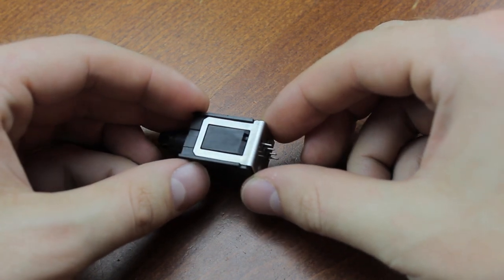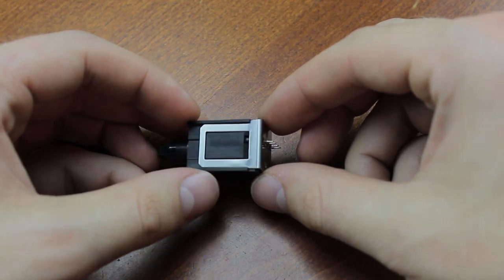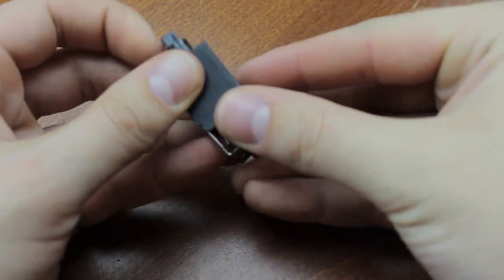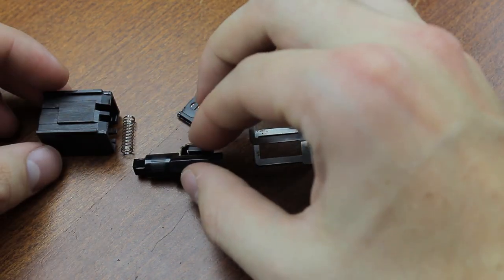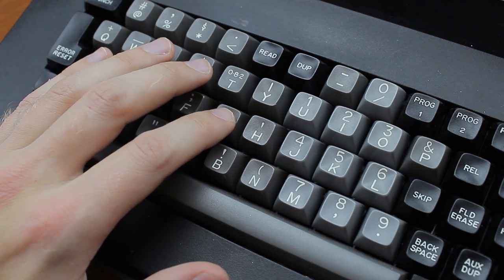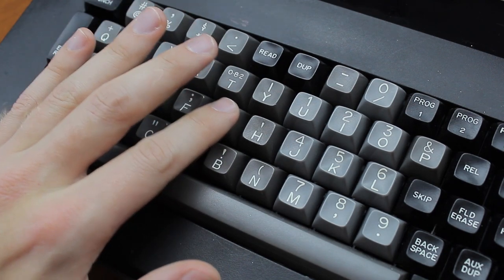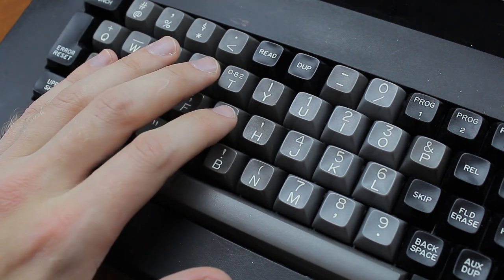By stark contrast, the dual magnet version has much larger switches that clip into a frame composed of metal loops like this, which you can very easily take off without even opening the case, let alone desoldering them, and once you've done that, the whole switch is also already disassembled. This is an absolute godsend if you want to clean out the switches quickly. In addition, I think there's a little bit more play in the parts, which results in a switch being far less susceptible to dirt and dust than the single magnet variety, without creating a large amount of wobble. Comparing this one to single magnet switches that were in similar condition, the difference is huge.